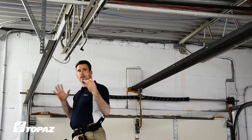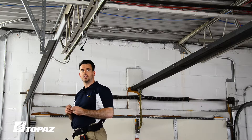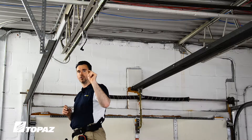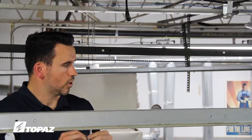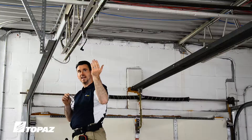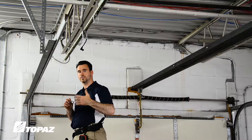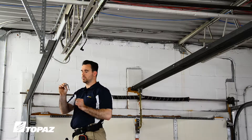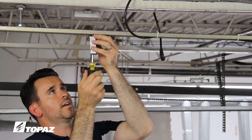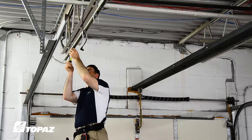While getting ready to put up your lighting fixtures, planning is very important. As you see here, I have laid out my two brackets per lighting fixture onto the mounting surface. Spacing and securing my brackets is going to allow this process to go very smoothly and quickly. This is my last bracket I'm going to mount — mounting it onto three-quarter inch Kindorf using a quarter-twenty screw and a fender washer.